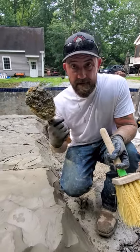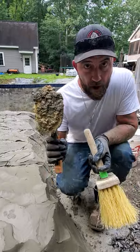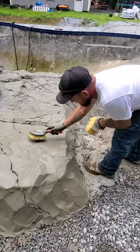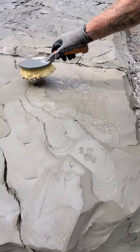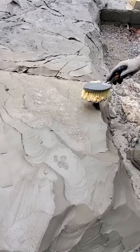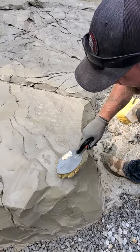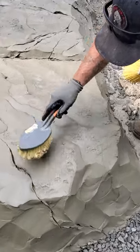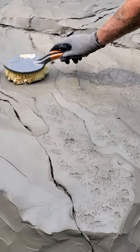Right now we're using these two brushes primarily. This one is maybe ten dollars in cost, pretty affordable. I don't use any mold release agents — nothing. I use water. I just dip it in water; I don't want it saturated but I do want it wet. All I do is touch down and give myself texture throughout, moving it in different directions and using different parts of it because you don't want to become repetitive.